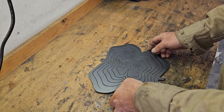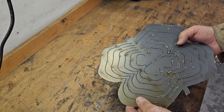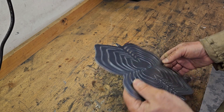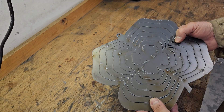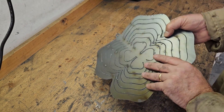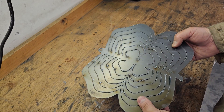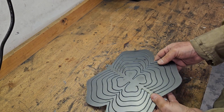So there's the shamrock spinner that I drew and cut out. It's pretty clean. One thing I did different on this cut is I lowered the air pressure. I've been running at 70 PSI and I set it to 55 because that's the spec for my PrimeWeld Cut 60, just to see if it made a difference. The air compressor is unloading. The cuts are clean, so I like that number.